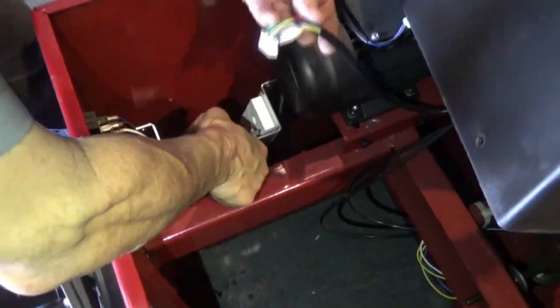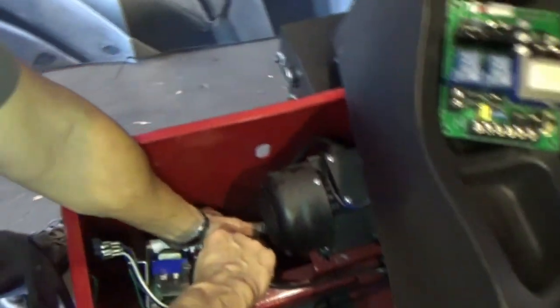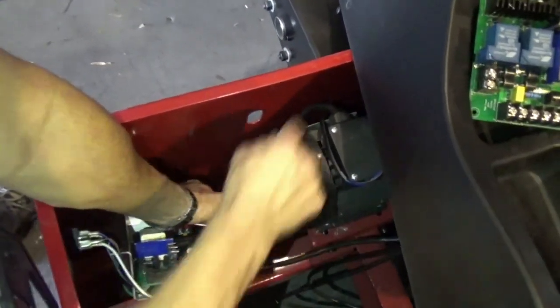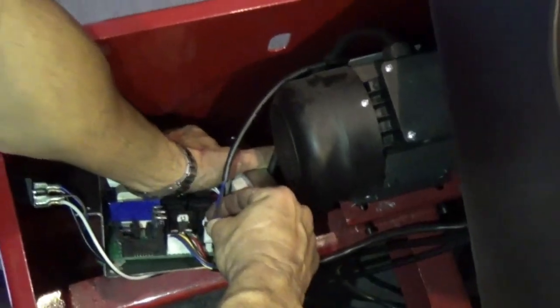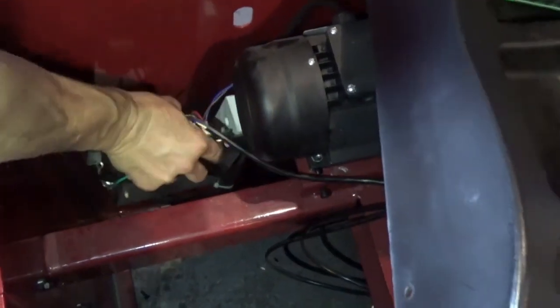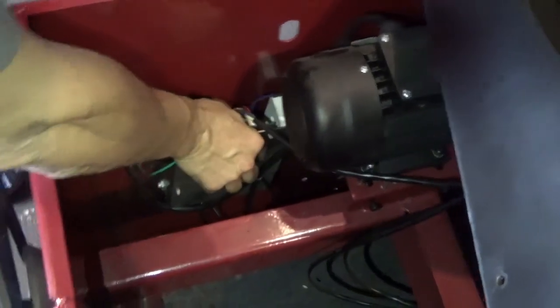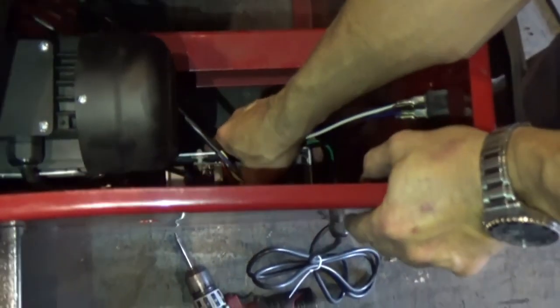And when you have it here, install the cable that you took out. Cable that's going to the power supply on the PC board, and the small cable for opening and closing the hood. When you're ready, place it in position and install the four bolts with nuts from the back to the front. That is a procedure that is simple, and this machine is ready to work.